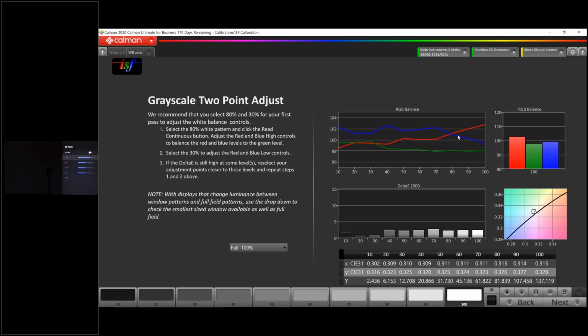Okay, these are all grayed out right now because the 20-point white balance is turned off, which tells me that we didn't use it last time. Let's turn it on and then reset it. This is one of the biggest things I was curious about to revisit this TV, whether they were able to fix these controls. It's kind of a bummer when it has them, but you can't actually use them. It's like the speedometer on your car says 150, but you can only go 80. It's like, oh man, I wish I could go 150, but that's okay. So those are back to reset and the 20 points turned off.